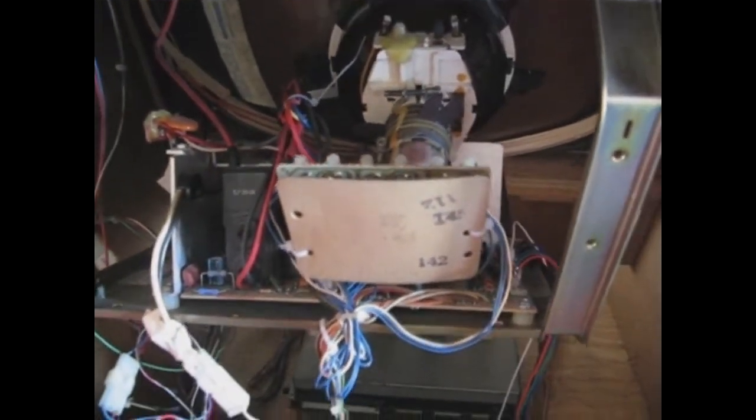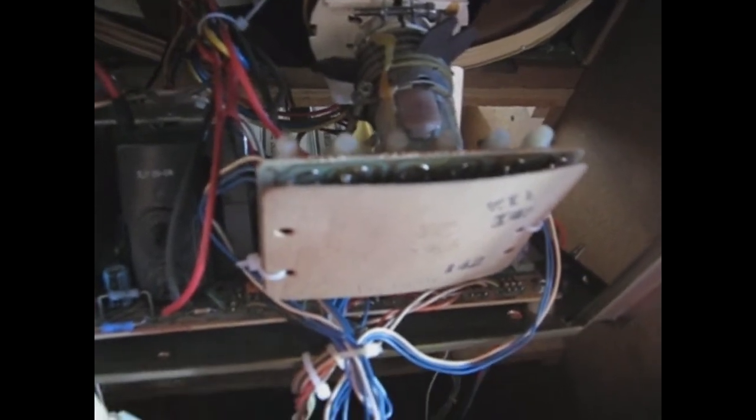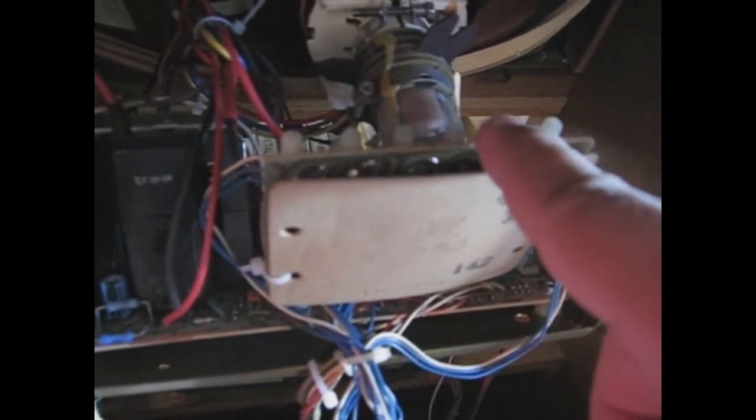So here we are in the back. I got the back panel removed. And if you look at the monitor neck tube — I'll try and put an arrow or something, but it's going to be that piece right there. Now, the first thing is there should be an orange glow, an orange light, and right now there isn't one. So that means something's come loose, and usually the thing that's come loose is the neck board, which is this right here.